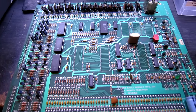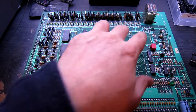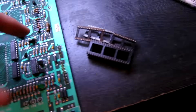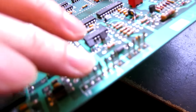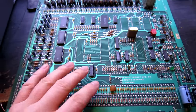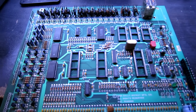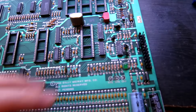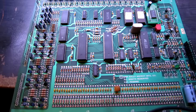So we've got the Strange Science CPU back on the bench. The reason was there were a couple of times when it wouldn't boot, and all I had to do was basically poke on the socket of chips and then it would boot up. So I've removed all of the socketed chips and we've got a pile of brand new turn-pin sockets here to fit. Additionally, while I'm at it, I'm going to replace the power connector with the newer Molex type. That should make this rock solid — let's get on with it. Through the magic of video editing, we jump to where all the sockets have been fitted as well as the new power connector, and now all the ICs are fitted and it's ready to go back in the machine.